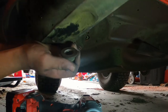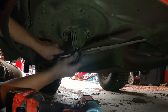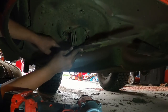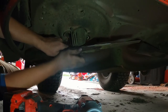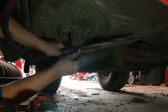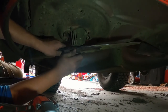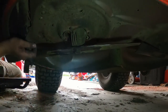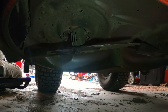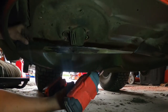So for the blade, after I scraped around a bit — these blades have been sharpened and balanced. You're going to want to hand-thread this as much as you can. The star bit is up here. You just thread it on — righty tighty, lefty loosey of course. Then on my impact, I don't want to get these on at like a thousand foot-pounds. Setting one on the impact — righty tighty — just zip them and check them with your hands.